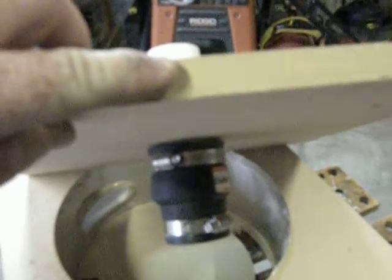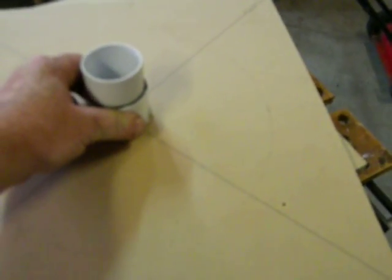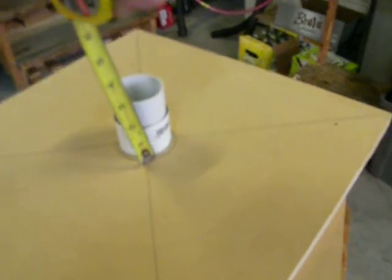Then you have your top piece. The top piece is just some central vac tubing — here's a small piece, there's the coupler, there's another small piece, basically a little bit thicker than the MDF. Take that small piece and wedge it in between these two couplers — just make it long enough so that the couplers can hold it in place. A little PL Premium, a little glue. Then this other little piece sticks out about two and three quarters to three inches, somewhere in that range.